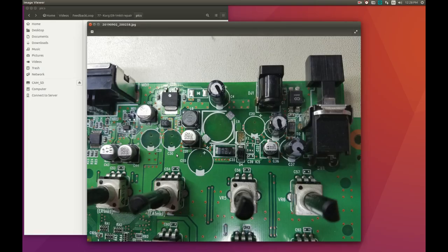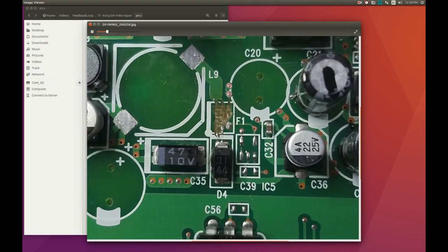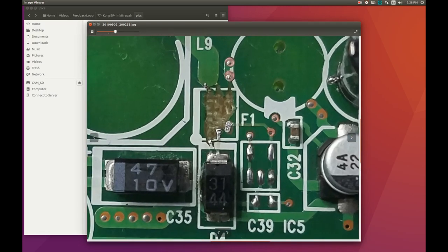Bad components are removed. Here was the blown capacitor, the broken inductor, and the step-down converter. The diode is fine - no problem at all. Here was the MOSFET, and I couldn't even desolder it easily - it basically welded itself to the copper traces, so I had to rip it out. The only part that survived was the gate, and it is damaged slightly as well.